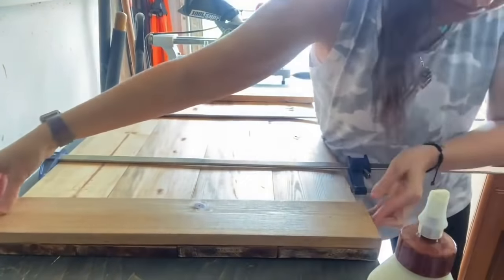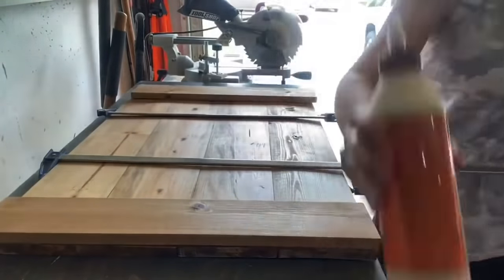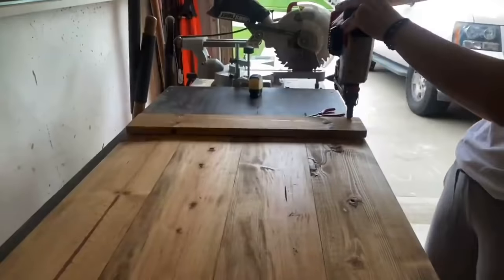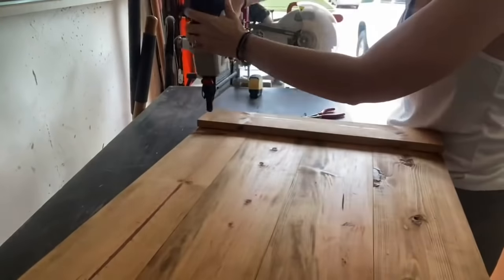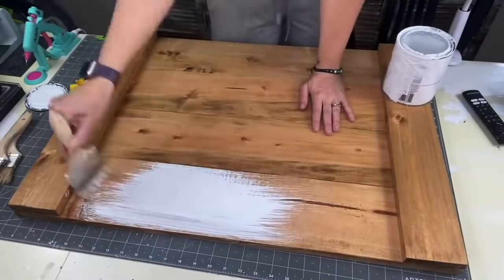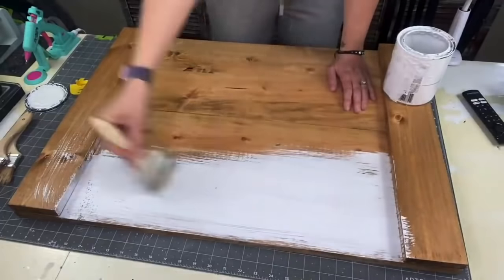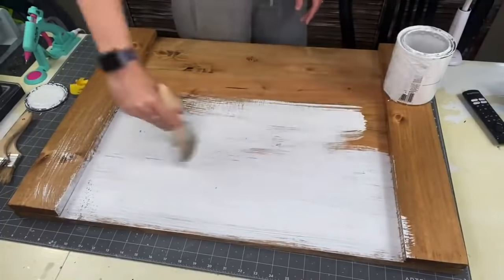Take your one-by-four pieces — this is where your handles are going to be. Set those on top, make sure they're flush with your edges, and repeat that step for the opposite side. Once dry, take your nail gun — you could also use nails and a hammer. I do suggest this because it's a super heavy piece, so more security the better. After that, take it back inside. I'm going to grab Linen White by Rust-Oleum and give this a healthy coat of paint. I don't paint the bottom, but paint all the sides, fronts, and where the handles will go.